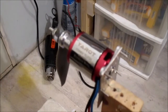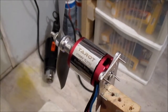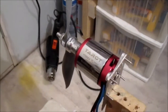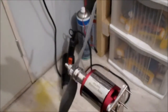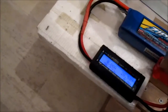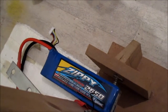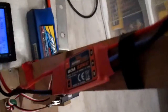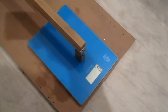I'm going to be testing it first on 5-cell. It says it's rated up to 6-cell. The specs on it were 75 amps and 1500 watts max. The prop I've got on there is a 7x5 APC electric prop, and I've got a Zippy 2650 45C 5-cell battery. The ESC I'm using is one of the HobbyKing red ones, 80 amp. Let's see what we get with a 7x5.